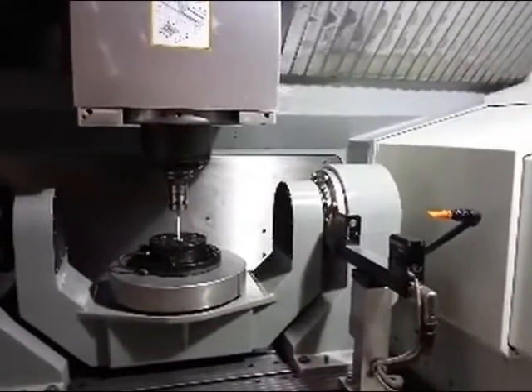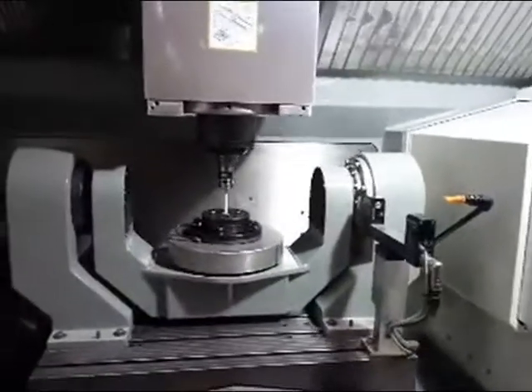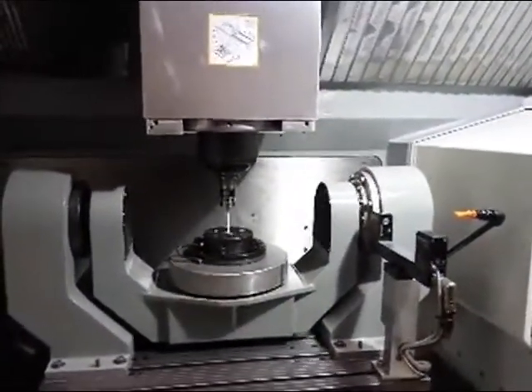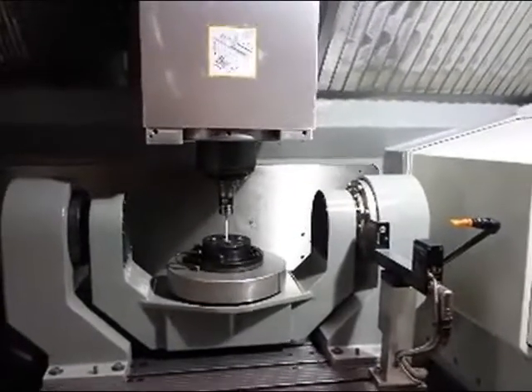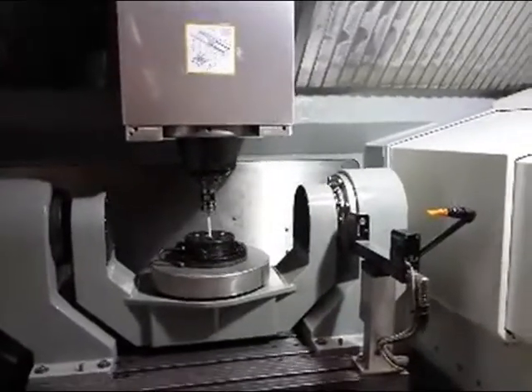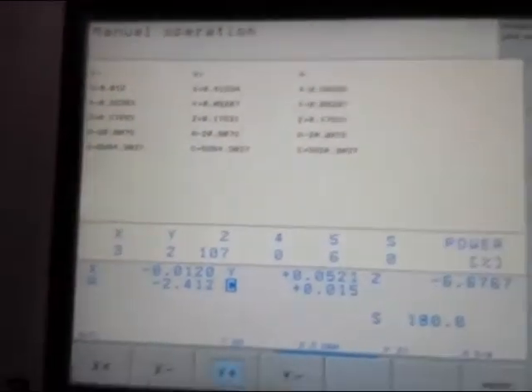You can do a lot of things with the touch probe — it's quick and easy. On the TNC 530i, you press 180 and it takes the orientation from the spindle and the touch probe. You repeat again: the probe will touch on again in XY direction or C direction, as you can see here, and it calculates everything out.